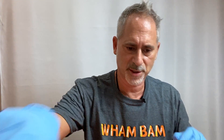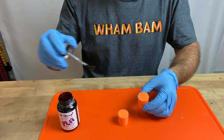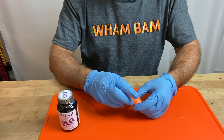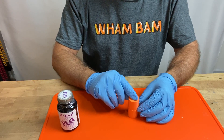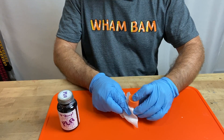I'm going to put on some gloves, because whenever we're working with these chemicals we do want to wear gloves, a face mask, and some kind of goggles. Safety is very important when working with these solvents and glues. I'm working in a well-ventilated area. We're simply going to take our two parts, put a semi-generous amount of Gloop on one side — you could put it on both if there's a lot of gap — then align them, clamp them, and if there's any excess coming out the sides, give it a quick wipe.